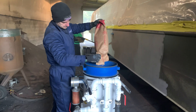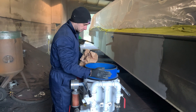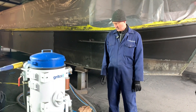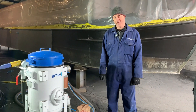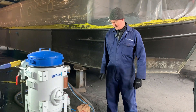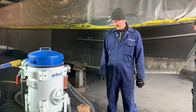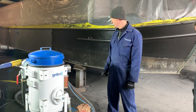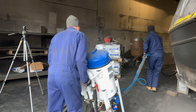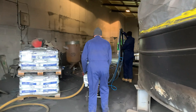The idea with these machines is to cut down the amount of abrasive used per vessel, but also to cut down the amount of waste. Getting rid of waste is very expensive these days — not only do you have to buy the abrasive, you have to get rid of it afterwards. By cutting down abrasive consumption by two-thirds, we can cut down waste costs by two-thirds, whilst giving a better finish and better speed.